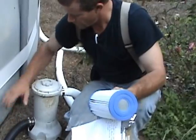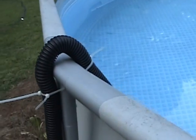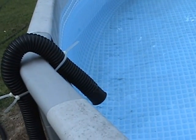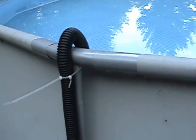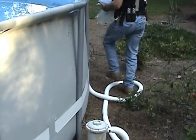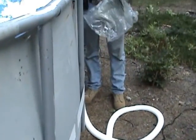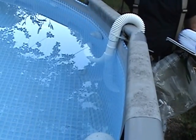Then we just got the pump, clamped the hoses all together, and ran them out so that they're all directly in the sunlight and the sunlight is heating it. We also need to show you how she attached it to the pool, because if you don't, the hose will not stay down in there. On this side, even with the pump off, if this hose goes out it'll be below the level of the pool and the intake hose, and it'll siphon the water right out of it. We dropped about four or five inches just simply from the siphoning action. The second one is the intake hose and the plastic is lighter weight than the water so it'll float, so she had to clamp it so it'll stay below the water level. Otherwise it would just float right on top and start sucking air — you wouldn't get any benefit out of it.